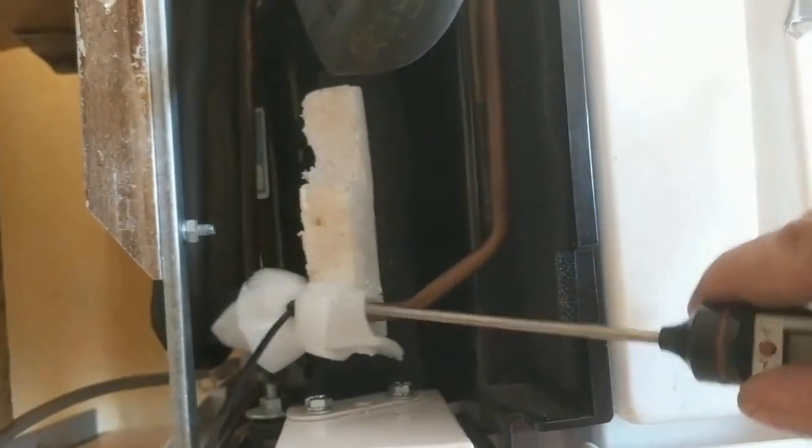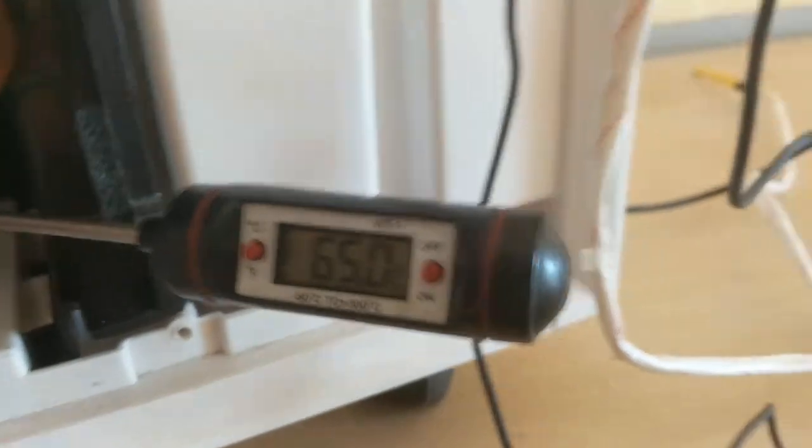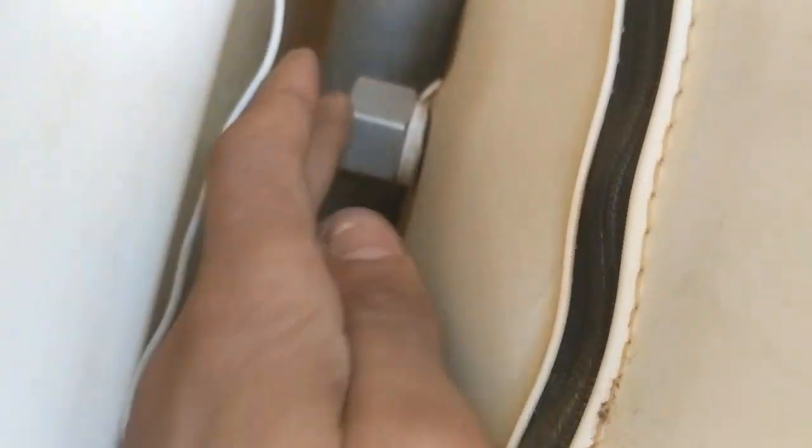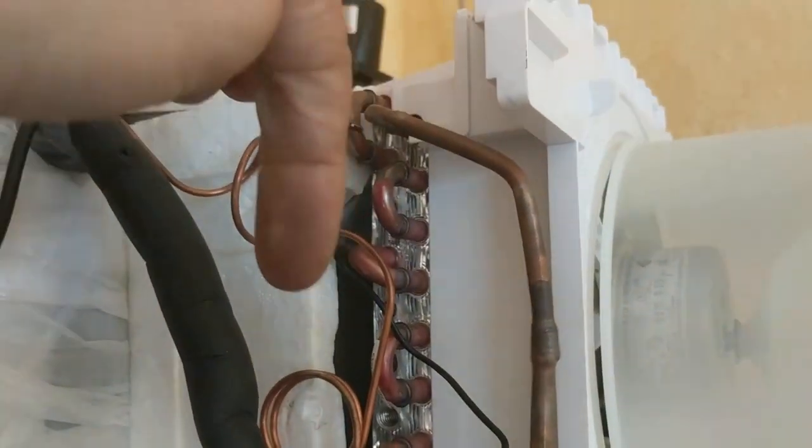The machine temperature reads 65°C — that's the maximum I've gotten so far, and it's definitely enough to heat the tank. The tank is positioned below, and there's a circulation port where I want to take the hot water out and run it down via a copper pipe soldered onto this one. Heat comes from below and hot water from the tank goes down — that's the perfect setup.